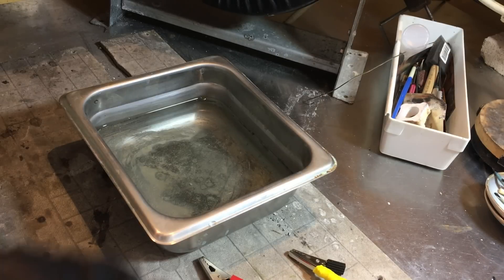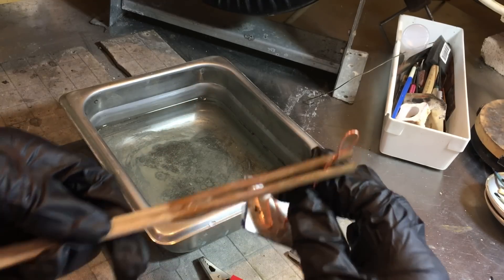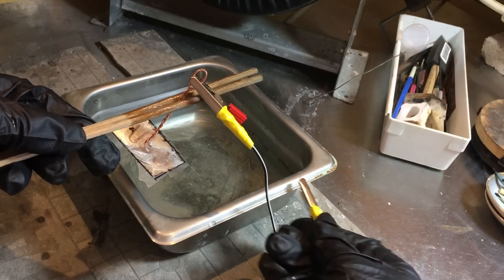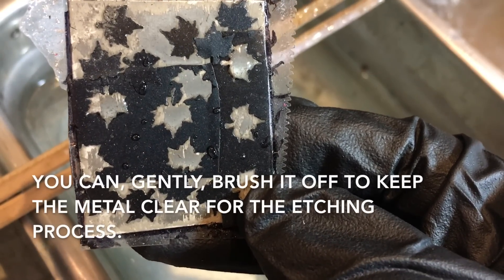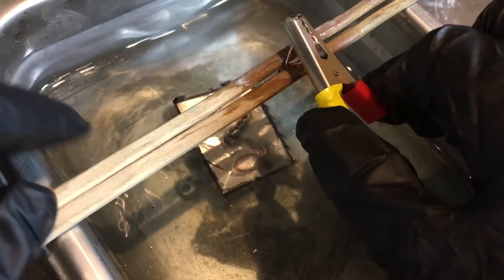Here we are at our silver nitrate. We've got our metal in my chopsticks, which I rinsed off after stirring. I'm going to slide this into it, clip my red lead onto the piece itself, and the black is just going to hook onto the pan. I've unhooked my positive lead here. You want to see something happening on here — you see that gray stuff? That means it's working. At this point I'm not seeing too much etching going on there, so we're going to leave it in — it's only been five minutes. Put her back in, let her hang out.